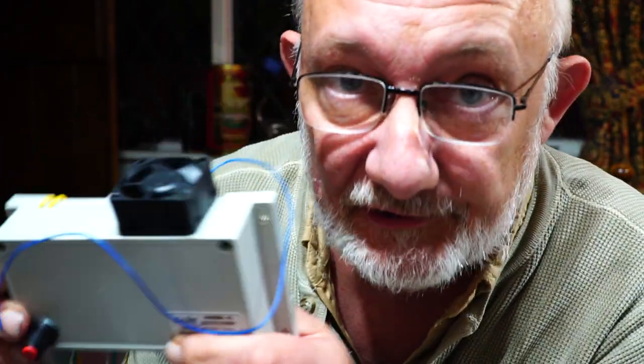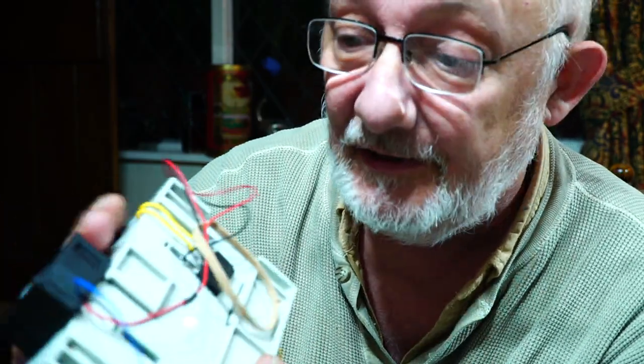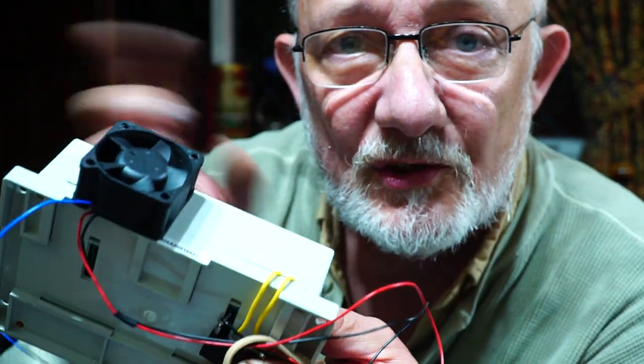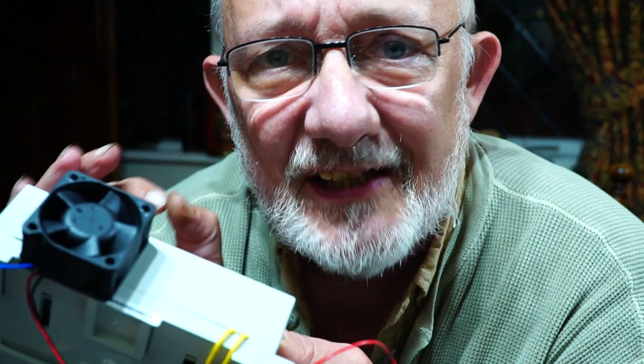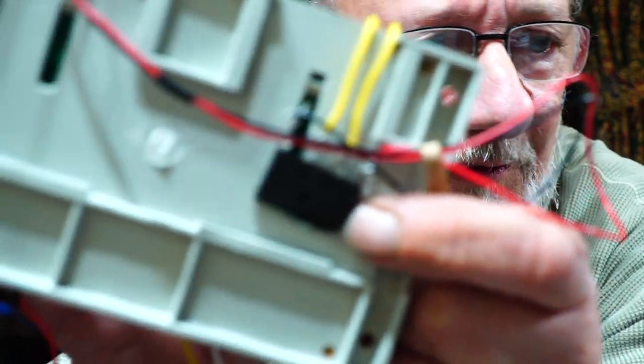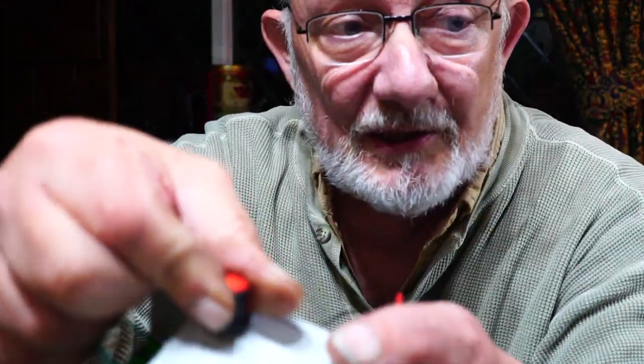But I didn't trust it, so what I did was I drilled a hole in the back and I fitted a nice, powerful fan — and it is a really powerful one, it really goes like crazy. And I nicked some of the power out here, because inside here it's got a 12-volt transformer which gives you 12-volt AC. But obviously I want DC, so bridge rectifier — a nice little bridge rectifier. I'm going to tidy up this wiring. And then you've got your speed controller here. So all should be jolly good. I'll let you know how it gets on. Bye.